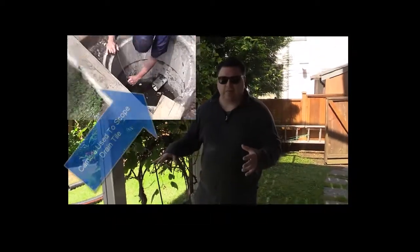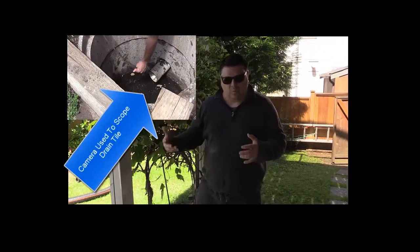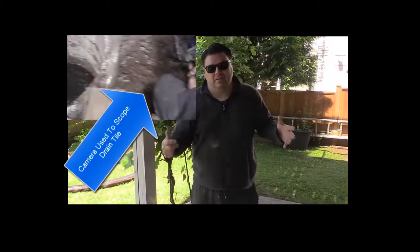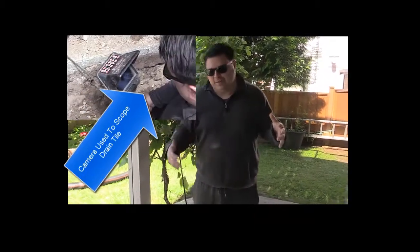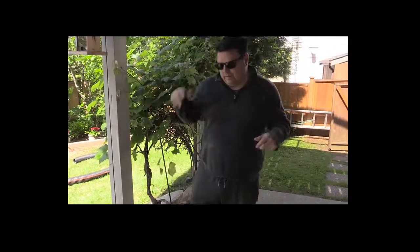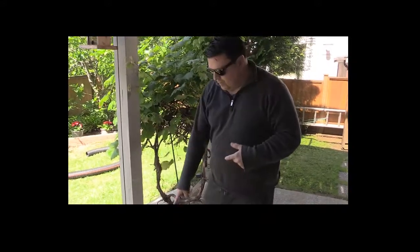The sump is an access point, right? So we can work on these drain tile systems without having to dig. Okay. But it went backwards on this job. But one is for the downspouts around the house. Okay. Then they tee in and they go in here. So the downspouts feed into the system? Yep, feeds into the system. And then the drain tile feeds into the system. And it's gravity fed, so it's built to come up. And now it goes out the access point down the hill.